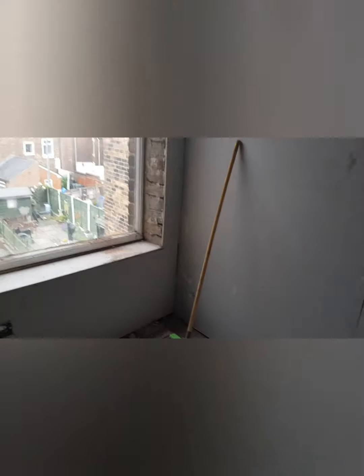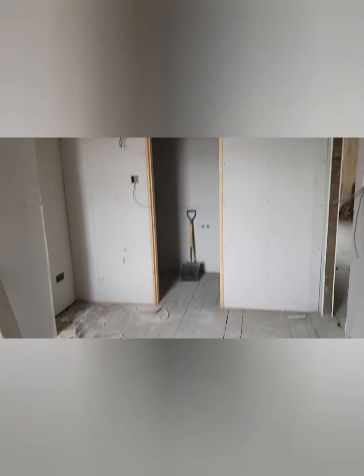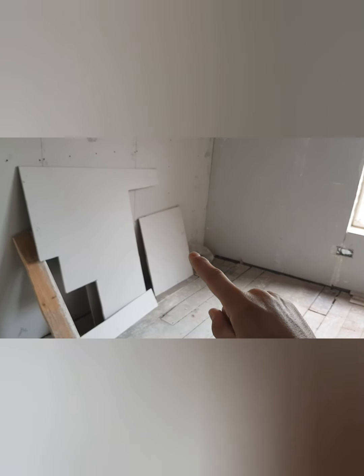Got a lot of boards in here, a lot of screws. So the bed's going to be here, bedside radiator under the window, set of drawers over there - so you're lying in bed and your en suite is right in front of you. It's all pre-planned from day one - that's the reason why we moved the door to here. Because if you can imagine putting the door there, where would you put your bed? The door opens this way, so either your bed's squashed under the window, which is not the best. Always forward-plan your projects. The en suite will have a shower on the right, sink in the middle, and a recessed toilet on the left. All the ducting's in.